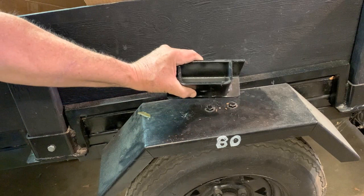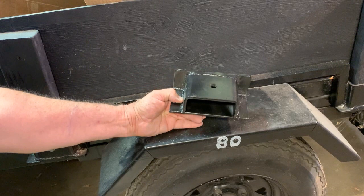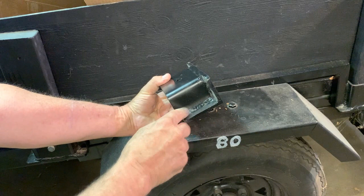So you could be quite busy with this. What you do is you buy the angled piece — you can get that from trailer catalogs of various types. Weld along here, do the best job you can, and then you're ready to take this whole assembly and weld it to the side of a trailer.